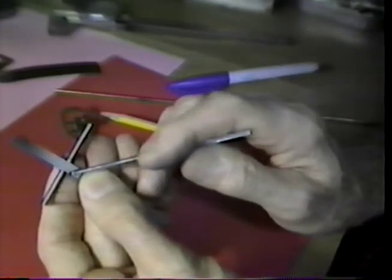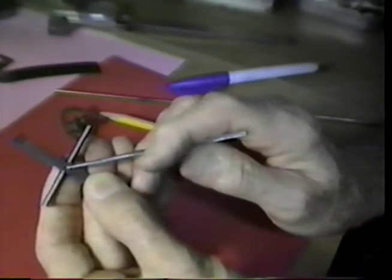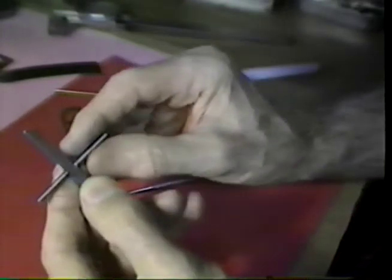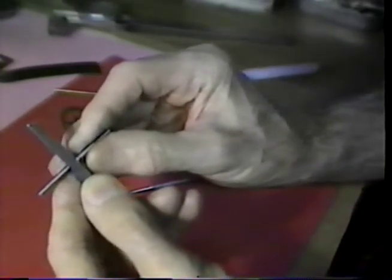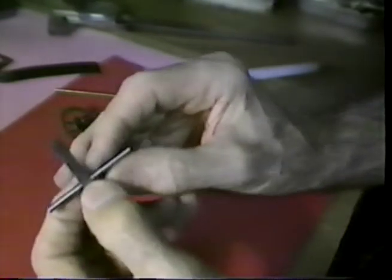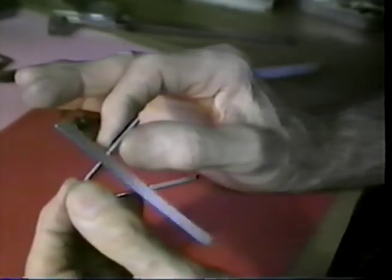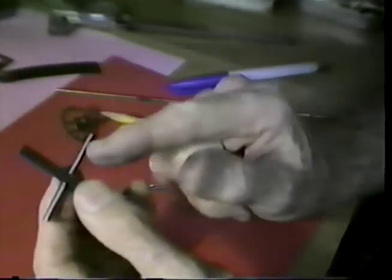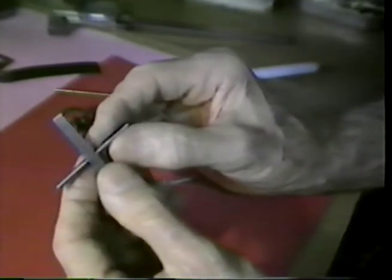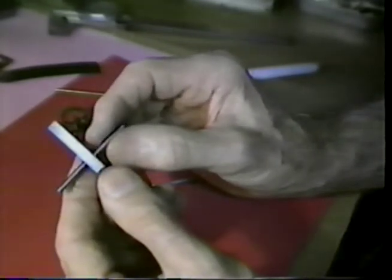Many of your American clock verges are made by this technique. Others have a hole drilled here and a rivet. In fact, fasten this as you may, but the thing I like to do is to snug this in place, check my adjustments and operation of the verge, and then lock it tightly. That gives me the ability to make some minor last-minute adjustments if need be.